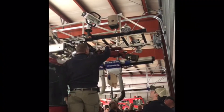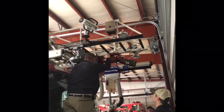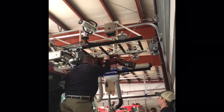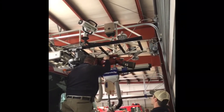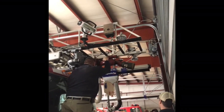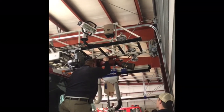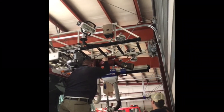See this one here? And there's one here. If you pay real close attention, when you move that switch and that's moving, this will be turning. That is a manual override — designed in there by the NFPA for exactly that reason, so you can override it. If that collector ring fails and I still need to move left, if you put a wrench underneath that and move it — is it slower? Yes. Will it still work? Absolutely.